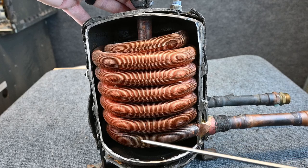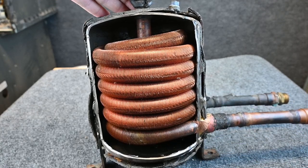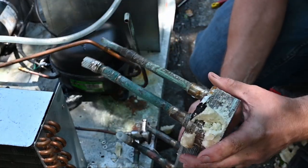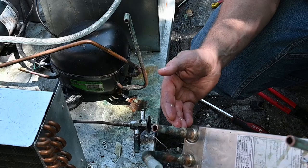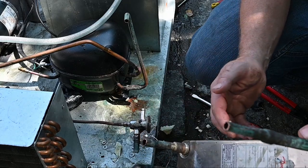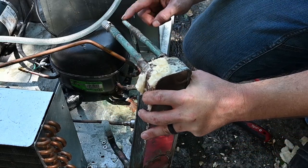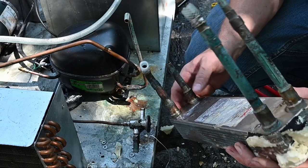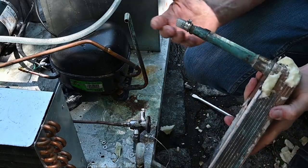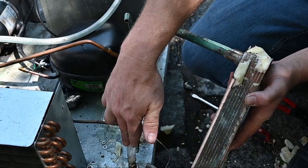And the idea is that we transfer heat from the fluid into the cooler temperature of the refrigerant. This is our heat exchanger or evaporator. Our metering device mounted to the very bottom. So the refrigerant came in as a saturated mixture. Refrigerant boiled from a liquid to vapor, then superheated to vapor and came out to the top side, going back to the compressor as a low temperature, low pressure superheated vapor. On the other side here, we have our glycol comes into the very top side and then it comes out the bottom.